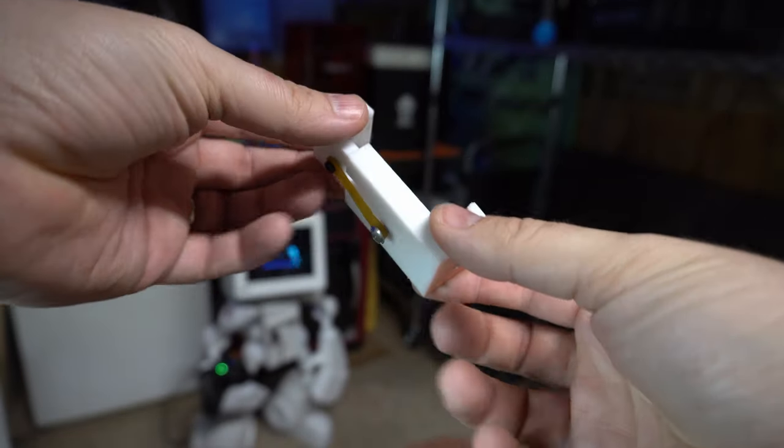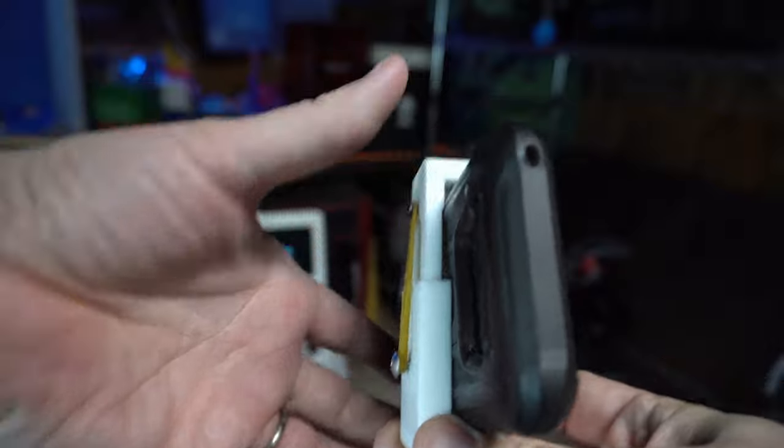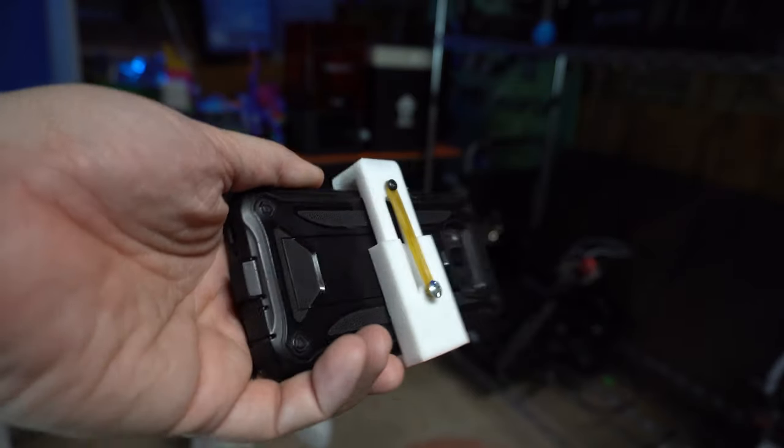At this point I wanted to say you might have to redesign things a little bit for TPU, maybe bulk them up. I was going to show this PETG print I use to hold my phone, because one part is relatively thin. When I printed it in TPU, sure enough I was able to flex it with my fingers even at 90% infill. However, something interesting happened: when I attached the rubber bands to it, it bends backwards just a little bit, but then when I put my phone into it, the phone pulls it back forward. So the case that was supposed to be an example of why you'd need to redesign actually worked perfectly. Is TPU just great in every situation and I've been ignoring the possibilities?